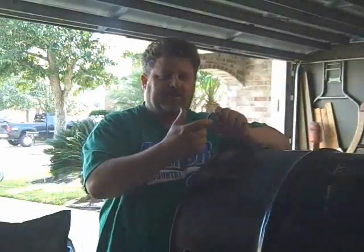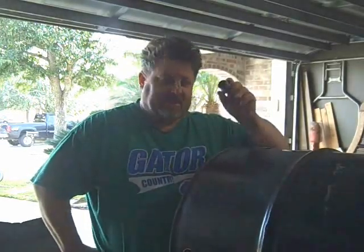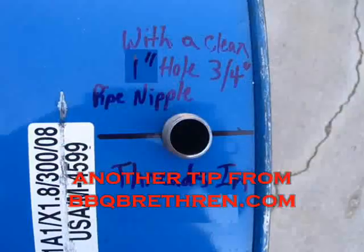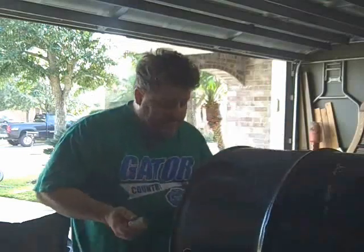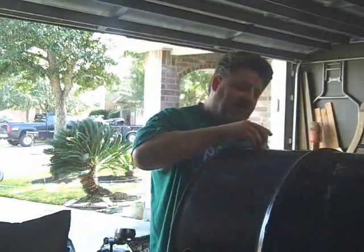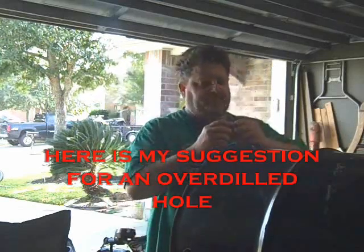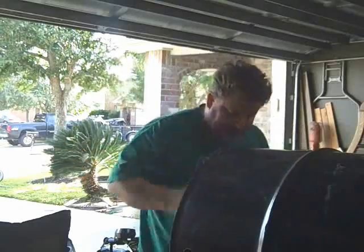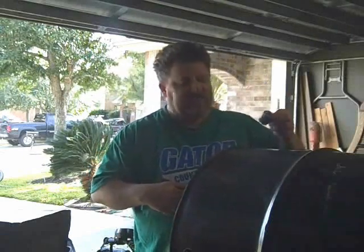One of the things to remember about piping is it's the inner diameter that determines the size of the fitting here. So you have to go one step up in order to drill. For instance, this is an inch and a half and I messed up and drilled an inch and a half hole, then got an inch pipe. And as you can see, there's lots of room there. But there is a solution because I was going to weld these — maybe I shouldn't weld them.